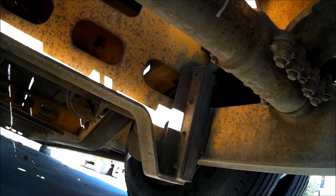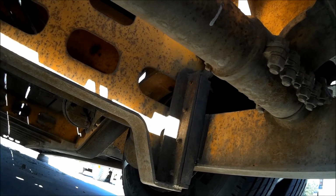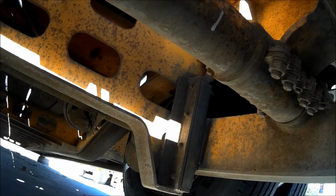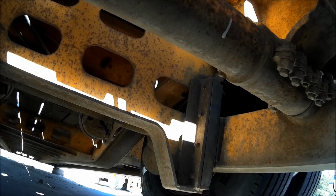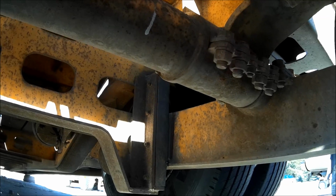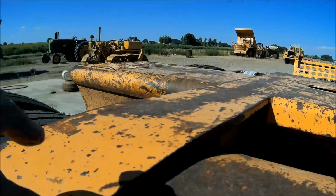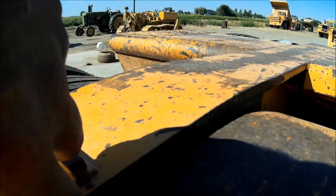And Sam in New Zealand asked me when I went around the corner in that one video if I hit the belly dump because it made this awful sound. Well, no, that's not what it is. It's this suspension back here creaking and groaning. But I'll show you what makes the popping. So you go around the corner, and when you go around the corner, it pushes on those blocks and they're worn. So this subframe comes over against the frame here. And this is the groaning and squeaking you hear.